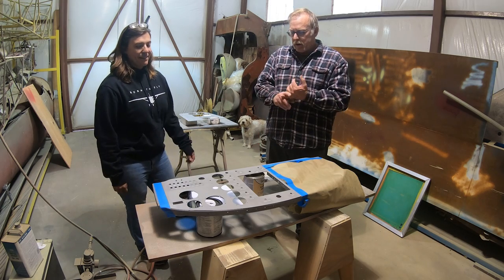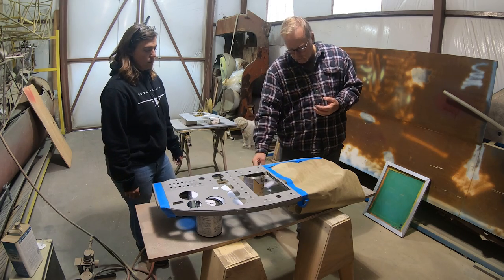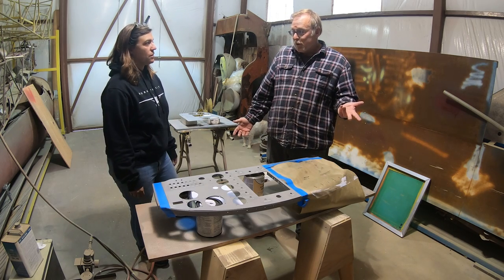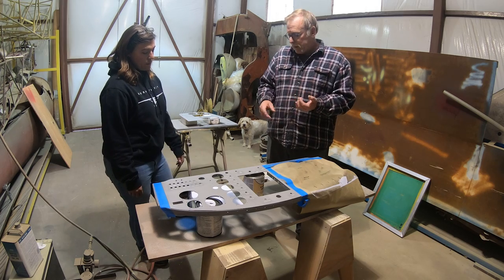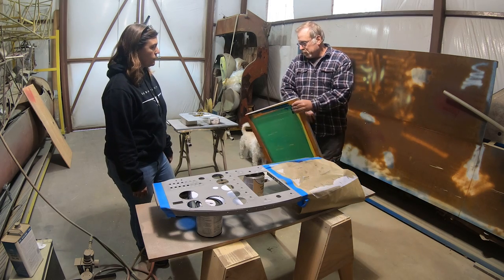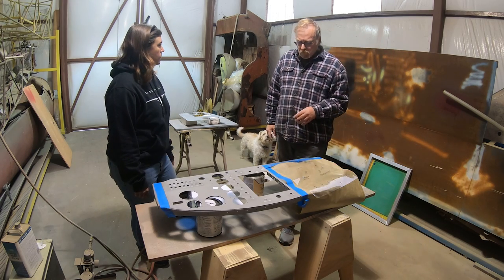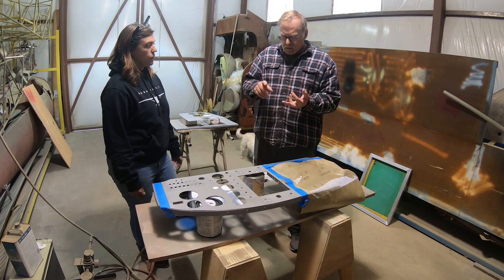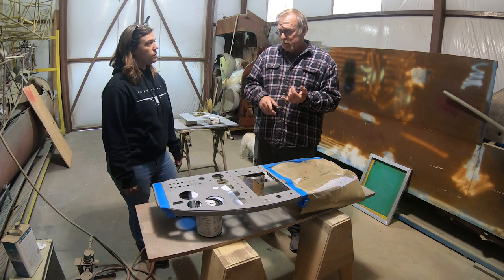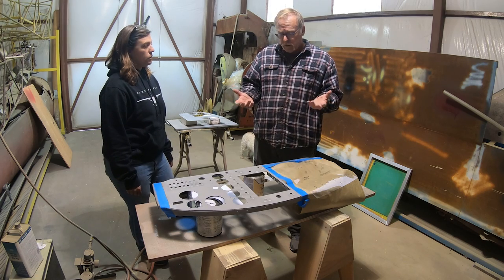So anyway, that's silk screening. Out of pocket, the emulsion's about $30. We got a fresh can of emulsion. We went to a local screen print shop and you got that done, $5, $35 total. Looks great. The screen I'm using is one of my screens, so I can reuse these. I think it's a 240 filament screen. Free software. The ink we used was about two tablespoons, which cost nothing, but if you bought a can, it's about $30. And a little bit of clear.